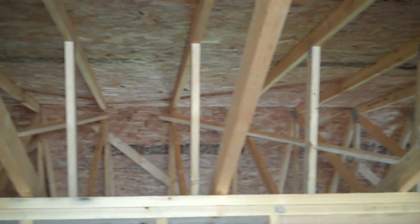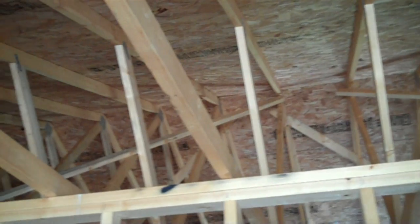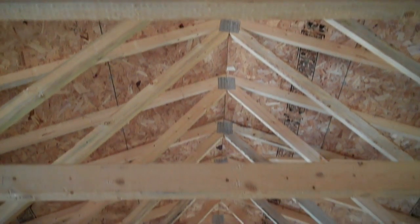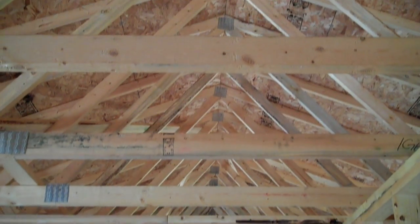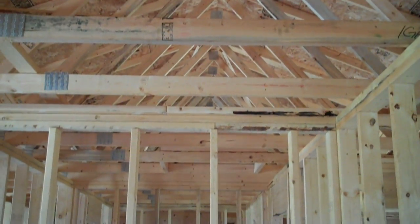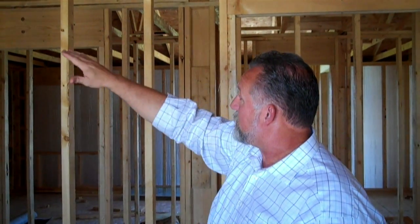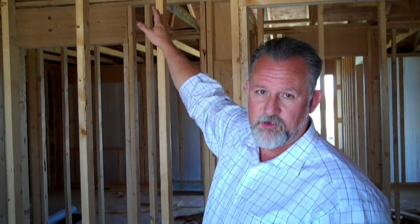There are two types of roofs you can go with. You can go with a truss roof, which this house has the majority of. These are pre-made at the lumber yard — they've fed all the information into the computer: the span, the roof load, where the webs have to be, and how big the metal plates have to be. The builder puts them up two feet on center, and they're tied together up top with crisscrossed two-by-fours so they don't blow down in heavy wind.